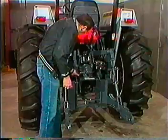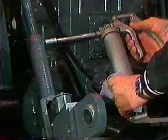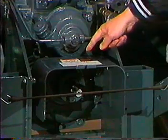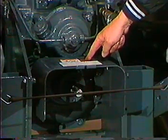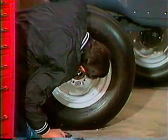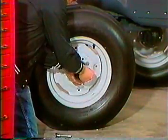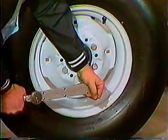At the rear of the tractor, check the fluid level of the transmission hydraulic system. The three-point hitch must be in the down position. Grease the fittings on the three-point hitch. The power takeoff shield must be in place with the warning information in view before delivery to your customer. If the tractor is two-wheel drive, remove the hubcaps and make sure the wheel bearings have been packed with grease, then replace the caps. The front wheel bolts should be tightened to 120 foot-pounds.